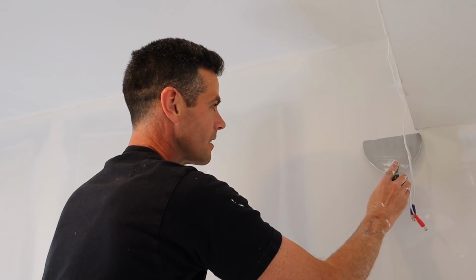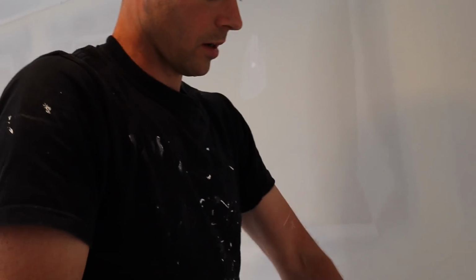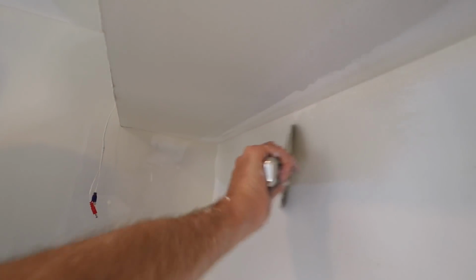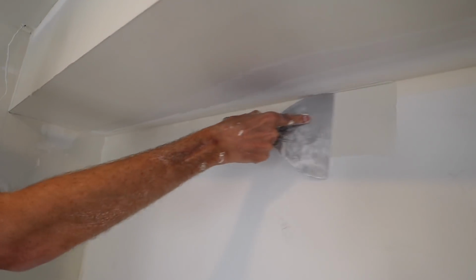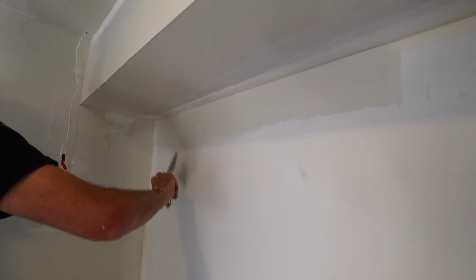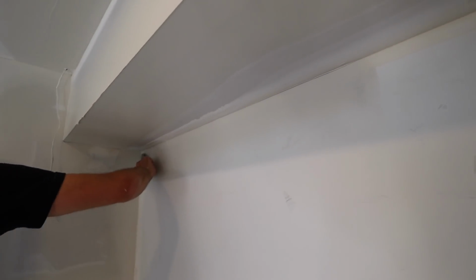But I wanted to bury that little spot right there, because it gives me a second chance to make it really nice. Okay, before I move along here, let's do this one. Why not, huh? And it's gotta be nice enough for paint, so I gotta make sure that I get the porosity out of it. Beautiful. Okay.